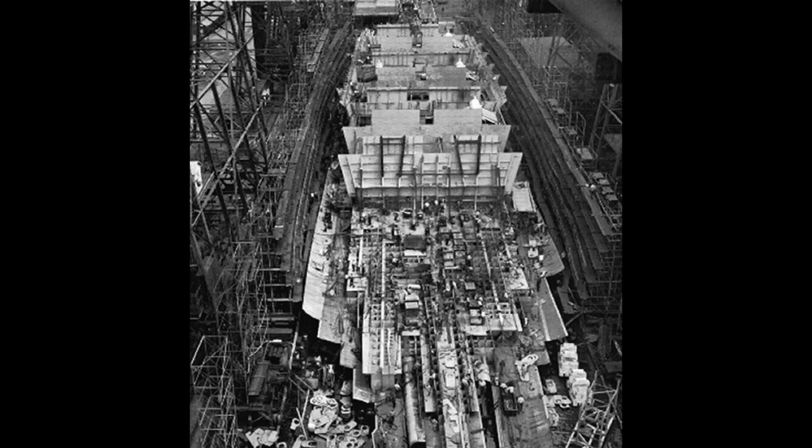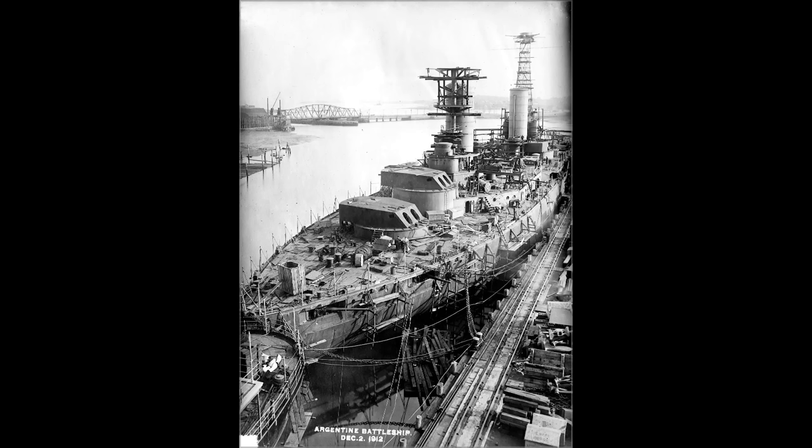There's an awful lot of complexity when it comes to the various types of steel that go into warship construction, especially dreadnought battleship construction. In the video about how to make armor, we touched on some of the complexities of making that aspect of the ship, but you can't just use any old steel in the rest of the structure either. There was almost as much — if not in some cases more — science that went into how to make a battleship's hull material as went into the armor material. The hull material had to resist longitudinal flexing, lateral flexing, rust, constant fatigue, shock waves, having things drilled into it, and having weights shift around all the time.